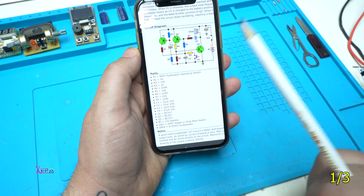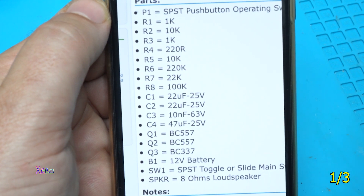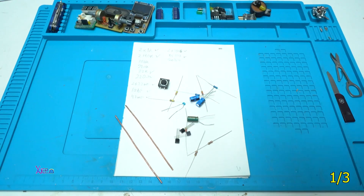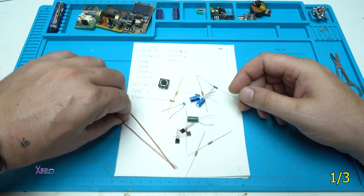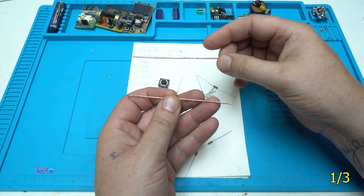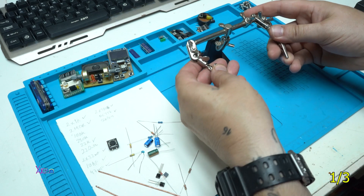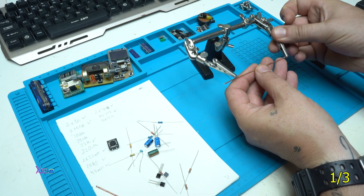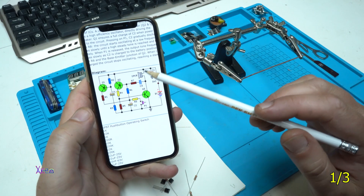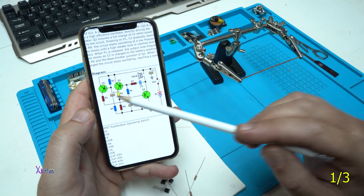Here is a close-up — you can take a screenshot so you can collect your electronic components and make your own very powerful and crazy siren. Here I have all the components needed to build my skeleton powerful alarm siren, and I'm going to build it on two solid copper wires. Let's start soldering — first I'll solder the two PNP transistors, the resistors, and capacitors.